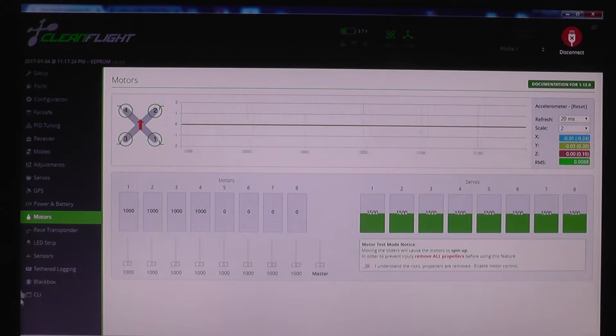Using the motor tab, I'm going to find the right idle speed where the motors run steadily to use as the idle speed and avoid the fly-away problem. The quad has the battery connected. I did not remove the propellers — it's better to remove them but at this small size I'm just going to keep it in my hand and use the master control to adjust them.